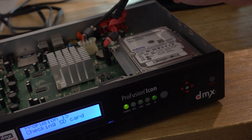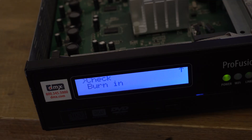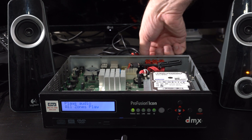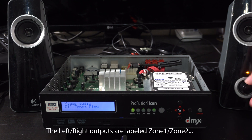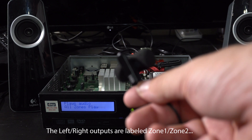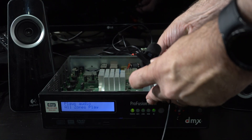The next thing I tried was disconnecting the hard drive and putting the SD card back into the working player. The machine then reformatted the SD card and went into some sort of fresh-from-the-factory mode where the only options appeared to be testing and loading software from a CD. However, I did get some sound out of it — it was announcing Zone 1 and Zone 2 over the left and right audio outputs, playing different zones to test the speakers.